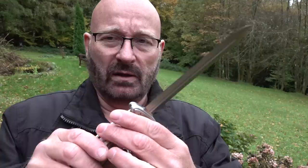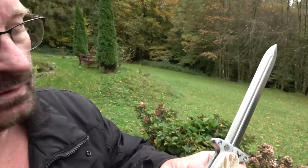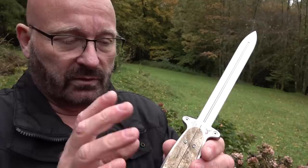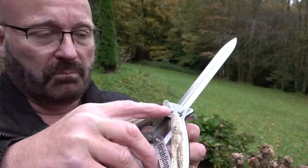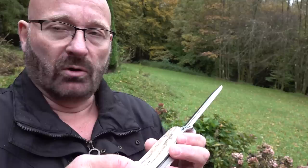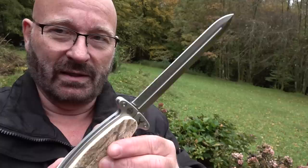And then of course the question arises: how solid is this knife? Really, how solid is it in comparison to a fixed knife? Well, it can never be as solid as a full-tang fixed knife — no folding knife is. But this knife is really, really solid because the steel bars here are all straight. So the vectors do not have an angle — they press right against the strong part of the steel, and therefore I don't think you can easily bend this physically. Also, the blade is held in place by this box here, which is really a big box of steel that's guiding it for about an inch right here. So it is very solid also against all side movements. But of course this is no pry bar — this is a knife that is designed to kill large mammals, and I think it's really well suited for that job, believe me.